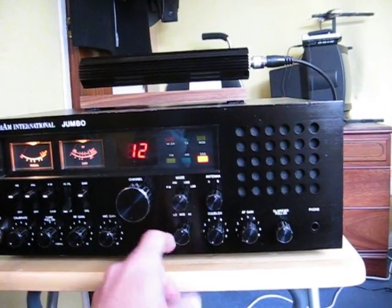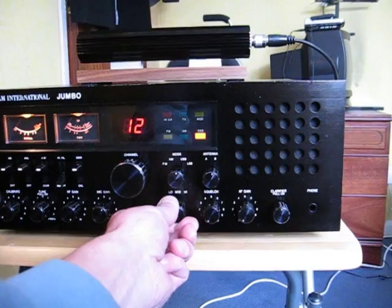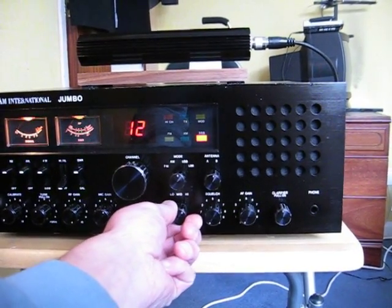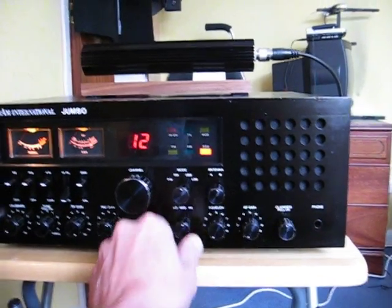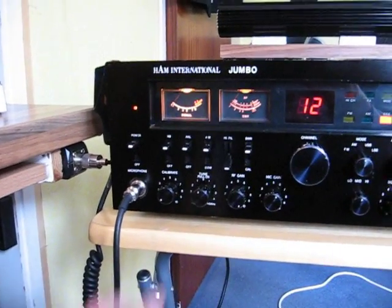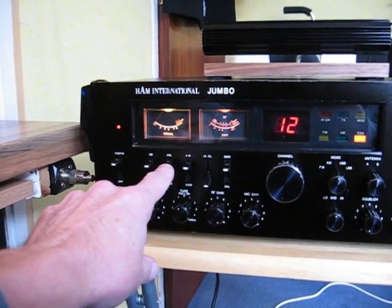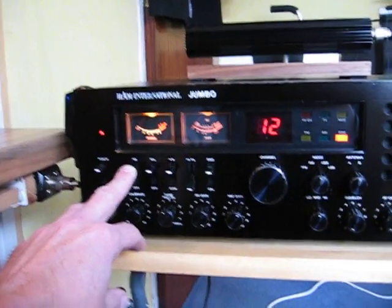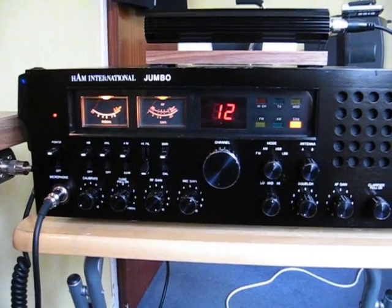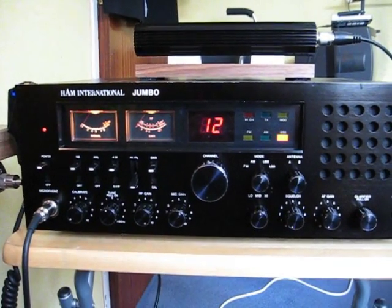We have a series of blocks of 40 channels. In the Mark 1 you usually have 3 — a low, mid, high — but somebody's added an extra block and the UK 40. Beneath the low they've added another 2 blocks of 40. They've also converted the ANL button to give the alpha channels, and the noise blanker button now turns the Roger Beep off. I'm not particularly fussed about modifications like that; I'd nearly prefer the radio to be totally standard, as it takes away from the originality of the radio.